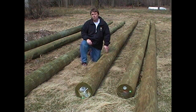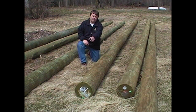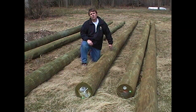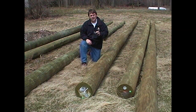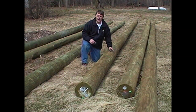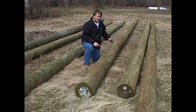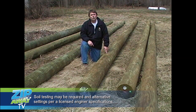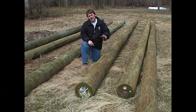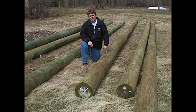A couple of things about a pole we want you to be aware of. First, you can tell the class of a pole and its length by a branding stamp, which is typically 10 feet off the butt of the pole. If that brand is not legible or has been scraped off, at the very base of the pole itself is an aluminum tag with just the class number and its overall length. So between these two reference points you should be able to identify what a pole is. Whenever you put a pole in the ground, the recommended depth is 10% of the overall pole length plus an additional 2 feet, and that will vary slightly depending upon soil content. Here at EBL, we do not recommend the installation of concrete products at the base of the pole, as this will contribute to moisture retention and rot at the butt of the pole itself.